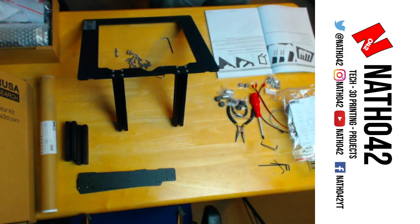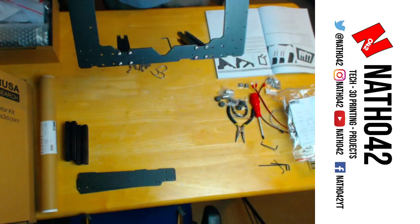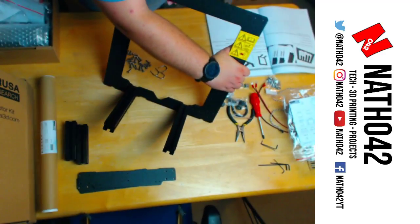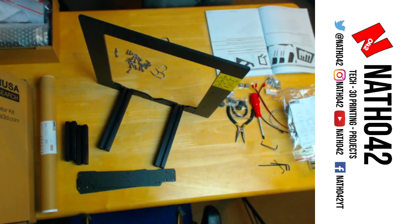Fairly tight. That's that side done. No washers needed or anything like that. Make sure the engraver... Ah, there's the part I should have read. Take the longer aluminium extrusions and place them next to the frame. Make sure the engraved Prusa logo on the frame, top left, is visible. Note, screws are inserted from the opposite side of the frame. If you need to manipulate the frame, make sure the extrusions are on the correct side. Ensure you're using the correct holes. See the second picture. Use the M5 screws to connect extrusions to the frame.